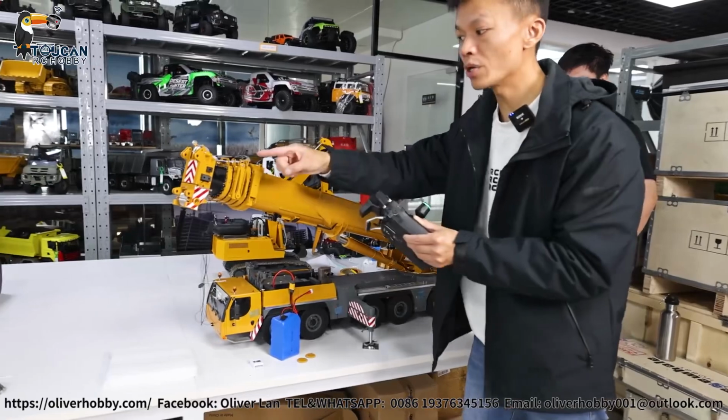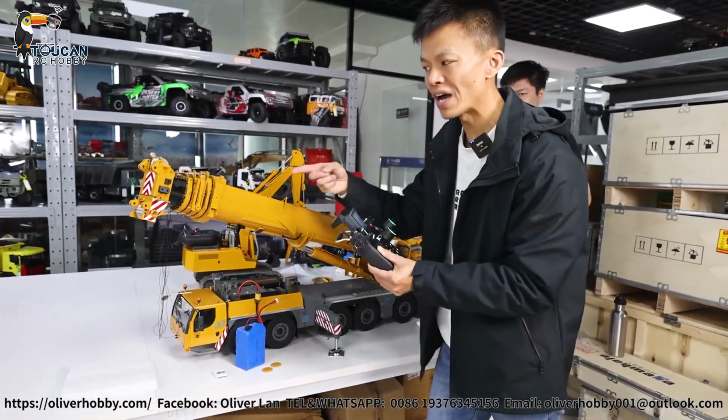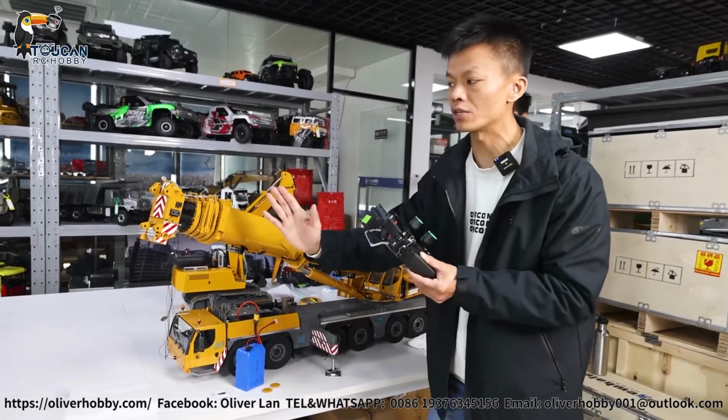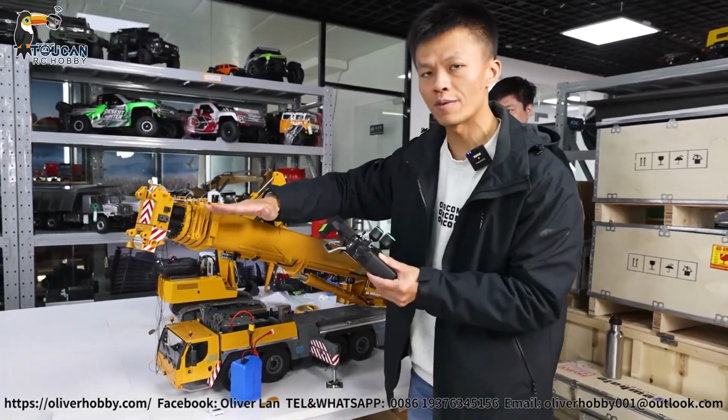Starting, it should be going. You see the timing, it's only around 1 second. First the pump starts for the pin to be sure in position, then it should be pushing out. If it's not coming out, you must stop, otherwise it causes damage.